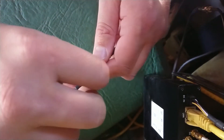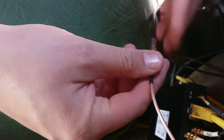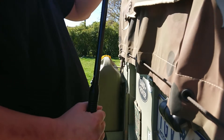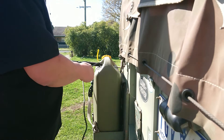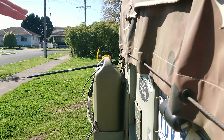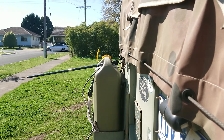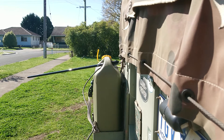I untangled the coax, unrolled it nicely, and left it in the sun to straighten out so there won't be any kinks. We're going to connect our other 4G antenna to this adapter and find a good spot for the antenna with reasonable signal. We're in the rear of the vehicle trying to find somewhere that doesn't interfere or run too parallel to anything metal. I'm thinking about a plastic jerry can — I could hang it out at a funny angle. The radiating element inside that tube is so small I don't think the 90-degree polarity offset will make much difference anyway.